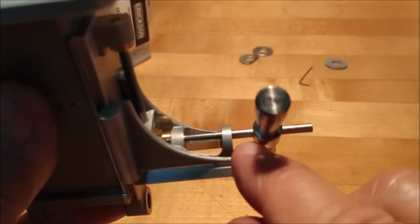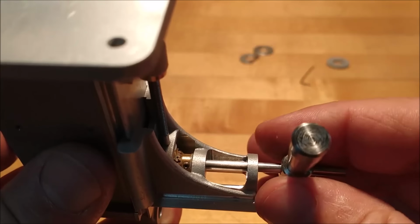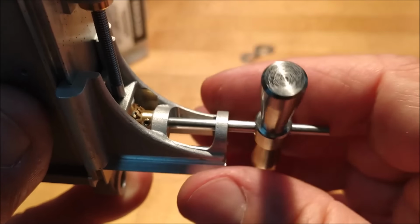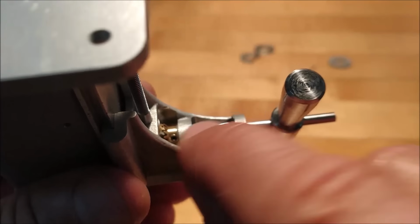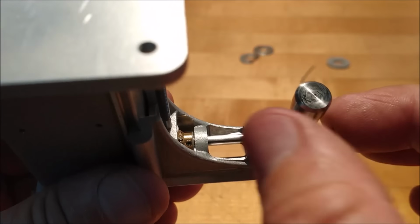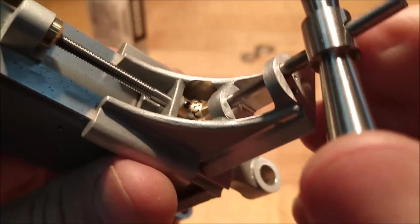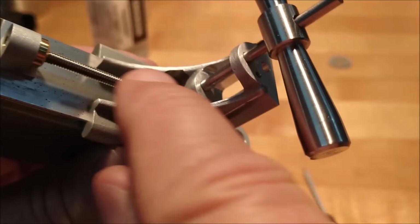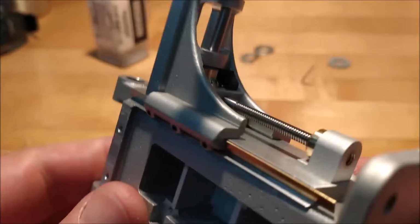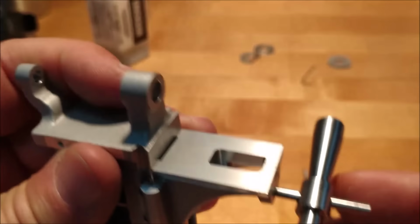Now the shaft that comes in from the front will have a collar on it so that it will not go all the way in, and the gap or the motion that you can see right there will not be present at assembly. That'll be adjusted out by the screw itself. We'll just push the lead screw in and choke up on the gear, taking the play out of it. That'll work. And as far as the shaft passing all the way through and bumping up against this, let me take it off and I'll show you the cap that I made for that so that this doesn't ultimately drill its way through the top.